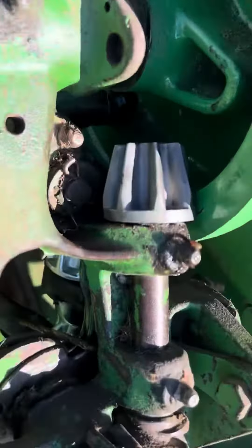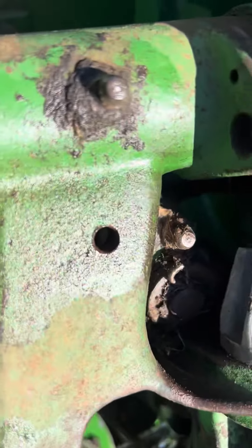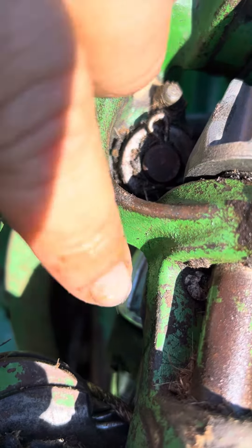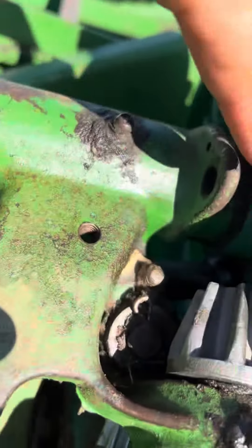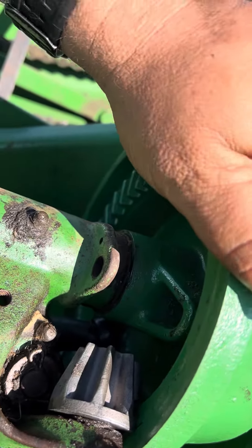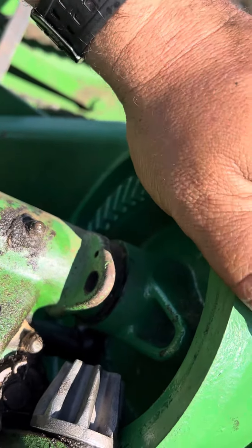When you set these knotter halves up, you've got to get the holder of the knotter lined up. See the edge of this lines up with the edge of the bail chamber down there. I usually run the needles up through to get them shimmed correctly. Remember, behind here there's no cotter pin, so you stack the knotter cam all the way against it.